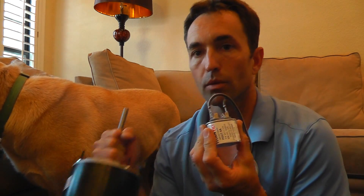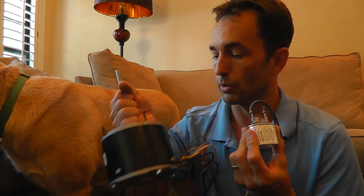So when we're putting our new motor in, a couple of changes are going to happen. It's a four-wire configuration. This is going to stay in your unit. The old run capacitor is going to stay in. Not the terminal hooked up to fan because you already pulled those off, but common and herm are going to stay on because this still needs to start and run the compressor inside the unit. So leave this in — that's fine. Keep it strapped in where it was. And what we're going to do is bring in a second dedicated run capacitor. Its job is to start and run this new motor right here.